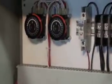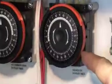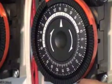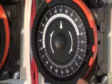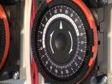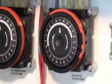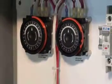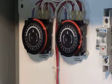In the upper left-hand corner, we have timers. These control the skimming and heating process. They're multi-event timers. They can be set simply by pushing in the keys to the time period you want the timers or skimmers to come on. We typically suggest you put the heating process on about an hour before your skimming to maximize the grease removal.